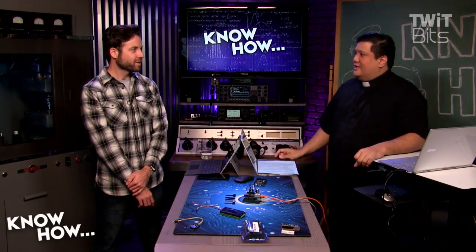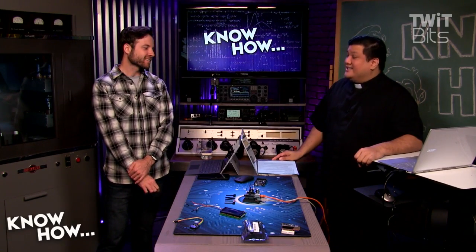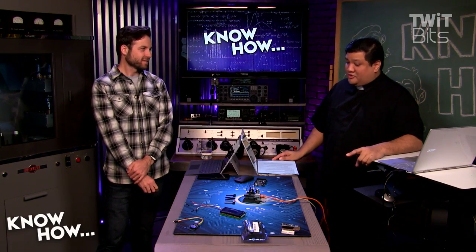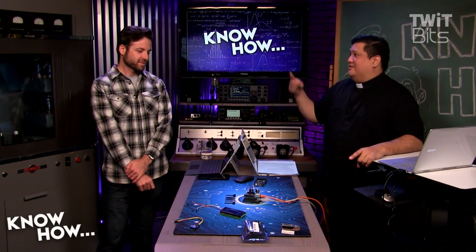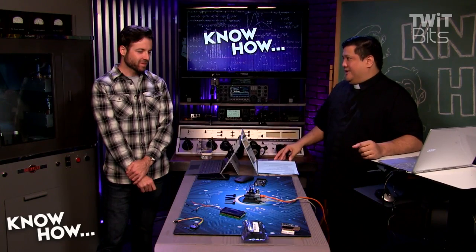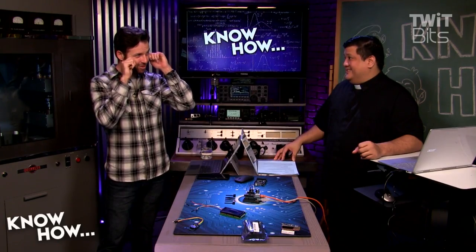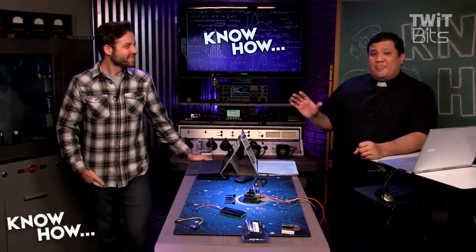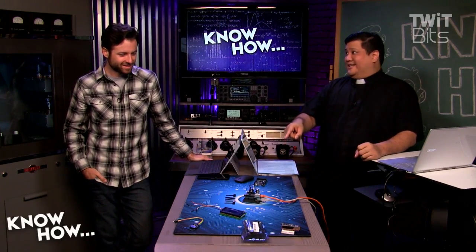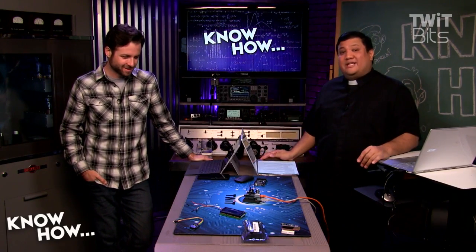Is there a danger of refreshing too fast? Yes, very much so. An Arduino is a very low-power device — it doesn't have a lot of horsepower. If you start requesting too much it will just start lagging and timing out. Also, let me make it clear: this is not a real web server. Don't put this on the internet to serve out your web page. That would be a really bad idea.